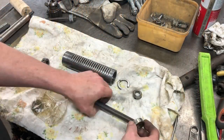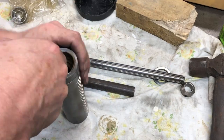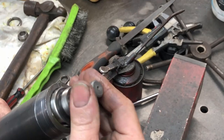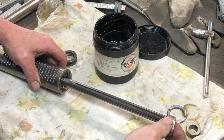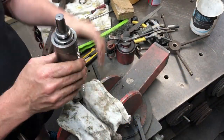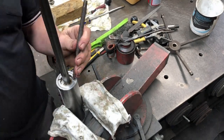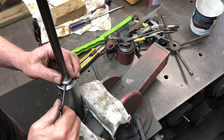Now I start working on the quill and the spindle. I've pre-greased these bearings. I pack some grease into the quill and that bearing gets pushed in — I almost got it in by hand but I needed a few taps with a wooden mallet. For the other end, again pack it with grease. There's a little spacer that separates the bearings and the bearing is pushed onto the shaft. I need to tap that on as well. This is a bearing retainer that screws in, going on the outside race. And then you have the centre piece that goes on the inside race.